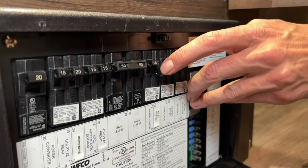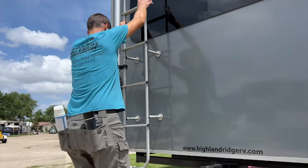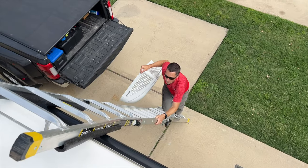The first thing on our list is safety. Before we take the cover off the air conditioner and start putting our fingers inside, I turn the power off at the circuit breaker inside the RV. Depending on how your RV is set up, you want a ladder that's secure to get up on top of the roof. I use a ladder against the side of the RV so I can carry tools and supplies up to the roof much easier.